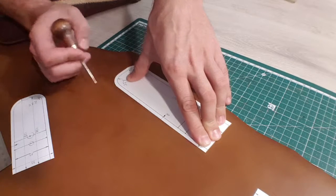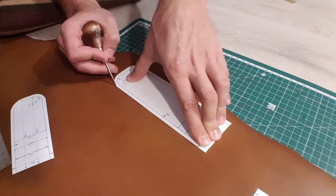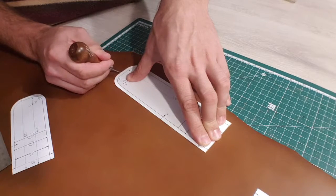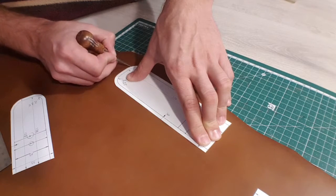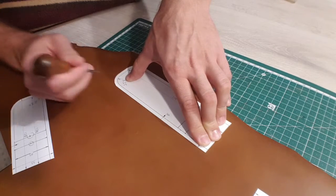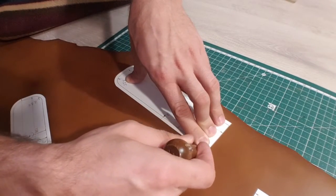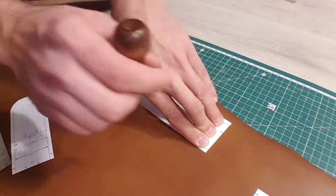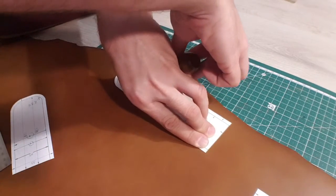First we're gonna scratch it. And then I printed out these, well let's say first I use SolidWorks 3D modeling program to sketch out my pattern. Then I printed it out at 100% zoom, so you get a 1-to-1. You want to make sure that's right, so that if you measure 3 millimeters, 3 centimeters, 10 inches on your model on the computer, you get that when you print it out on the paper.